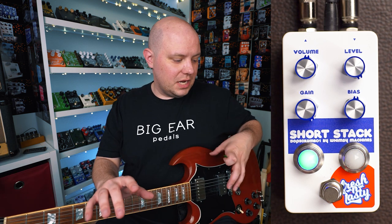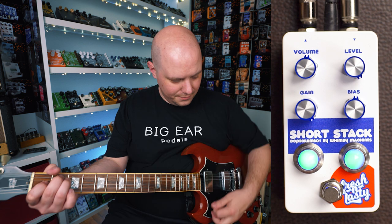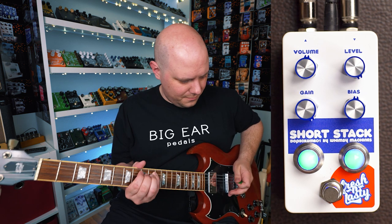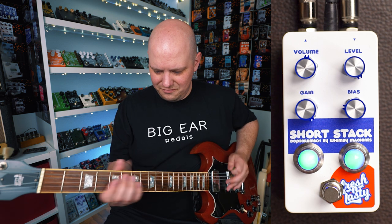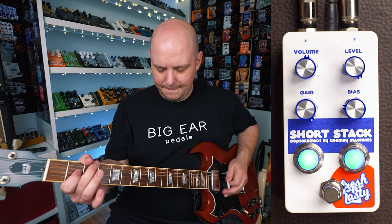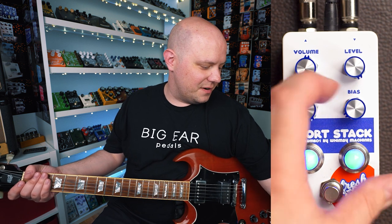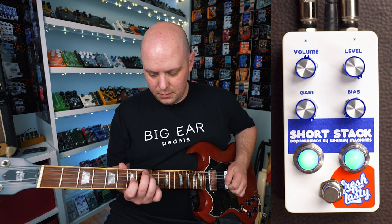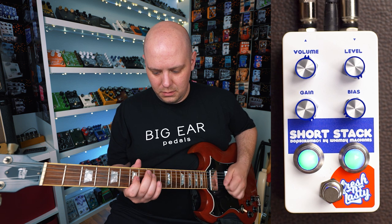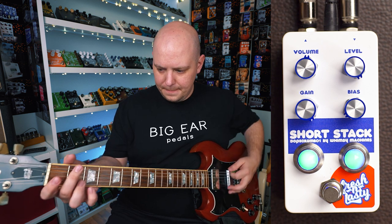Now, if we want to get the starved fuzz type of sound, we can turn that bias pot down, which starts to give us that kind of like sputtery sound. We're already getting there, but we can turn it down even farther. So there, we're getting pretty sputtery.